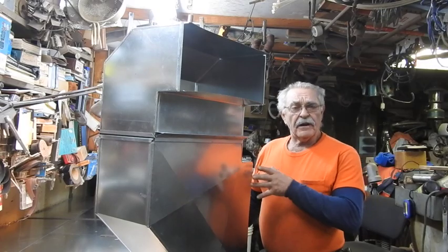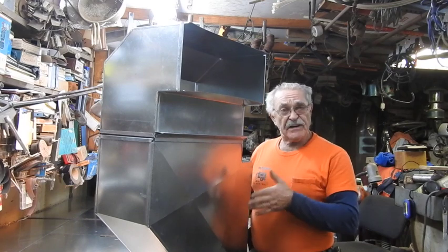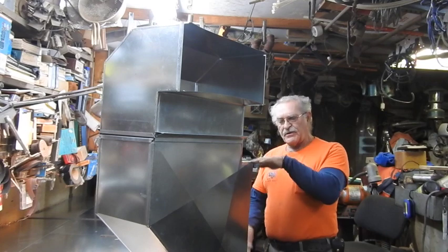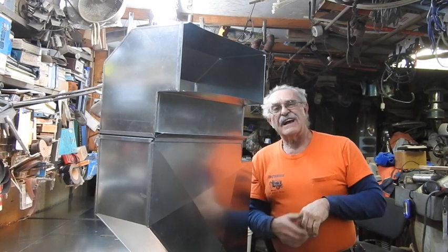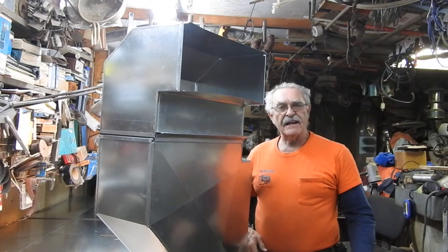Here's a classic example of a long way and a short radius in combination doing this thing to change the direction of airflow. You can see it entering vertically here with a 20 inch dimension vertically, going upwards, turning, and delivering the 20 inch dimension horizontally. So this is a long way going into the short way, doing this thing to change direction.